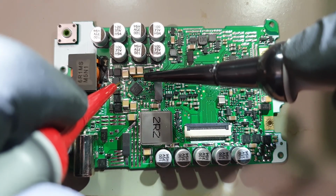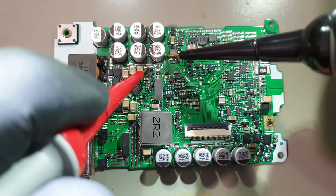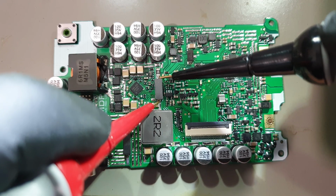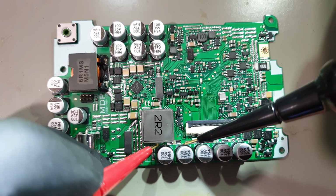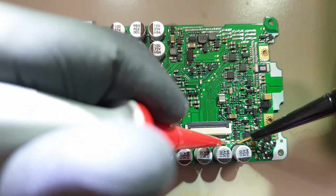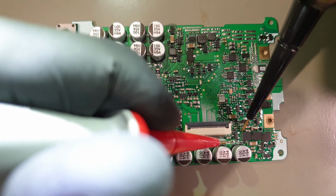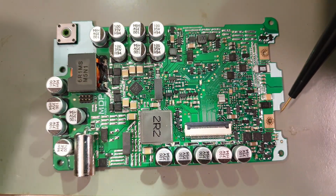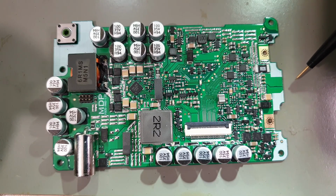That's what I meant earlier when I said that the output of such a switcher is not that clean. So it's buffered and smoothed slightly in a second bank of electrolytics. And then smoothed even further with a long ferrite bead, a big inductor, and a third bank of electrolytics. The voltage here is still a little bit too high, but now fairly clean. The final regulation to the output voltage is done by these transistors in a linear mode. And the terrible energy efficiency doesn't matter, because it's just such a small drop. Over here is a low-side current shunt and what might be a traditional differential amplifier made from 3 discrete op-amps.